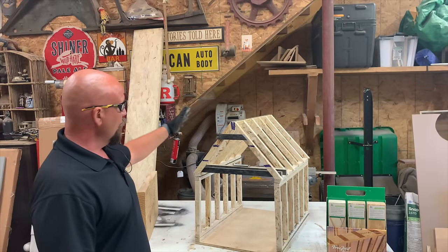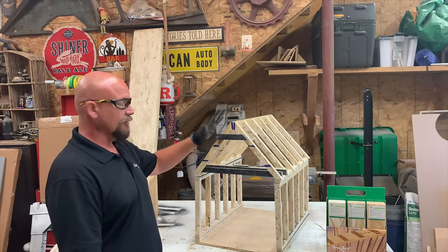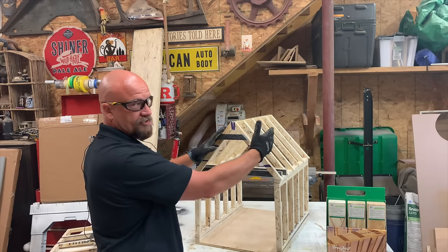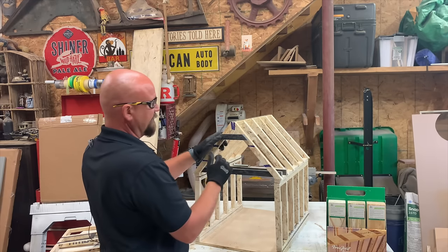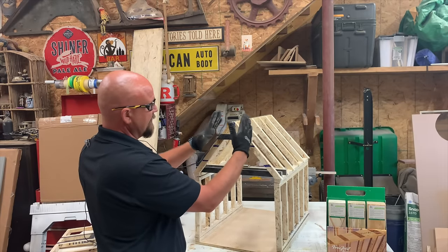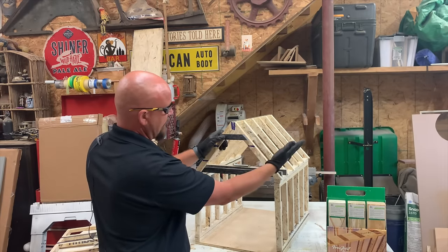In the upper third of the roof, we have what we call a tension tie or collar tie. This assists the rafter tie, but also helps with compression and tension from wind loads. The windward side pushing in on the roof creates compression, and on the leeward side coming over the top, we're creating a suction scenario that wants to lift or pull the roof off in severe storms.